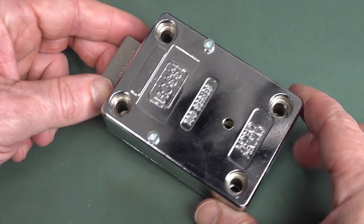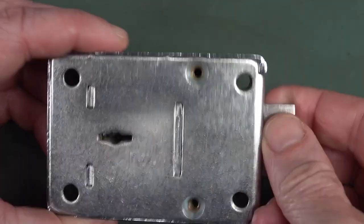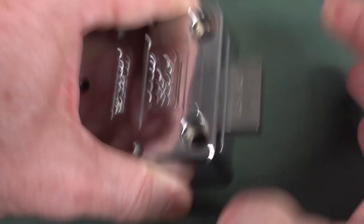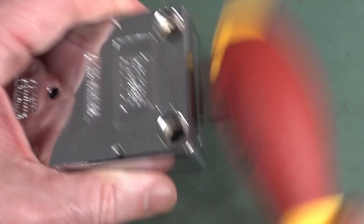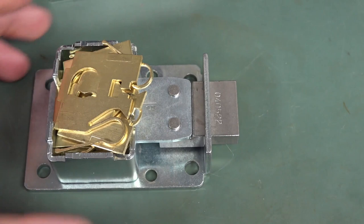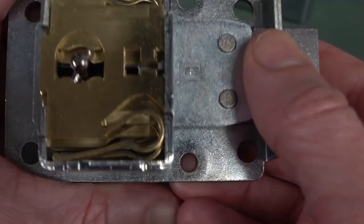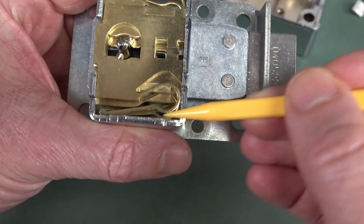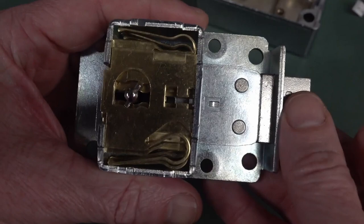Let's tear down this 700 Series Ross lock with nine levers - we're talking 1.9 million combinations for the dual-bitted key. I'm having a hard time getting this apart; the machining and fit of this thing is absolutely incredible, and that's one of the security features of the Ross Locks. There we go - all the levers came out. Check out that solid diecast piece. What's more amazing is the design of this 700 Series. They've got nine different levers, and they're alternately sprung - this top plate is sprung this side, the next plate is sprung the other side - so they're alternately sprung, which adds to the difficulty of picking.